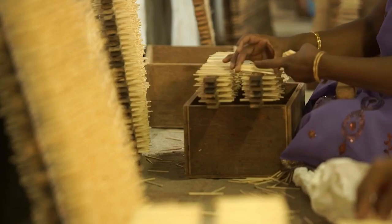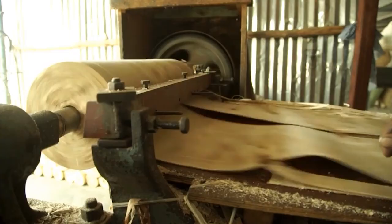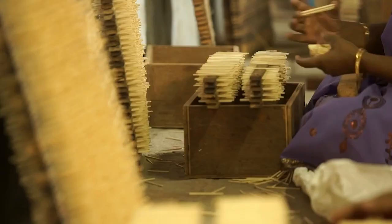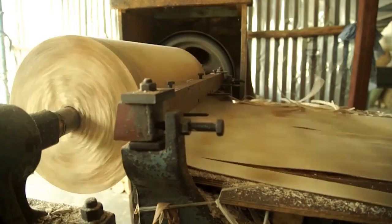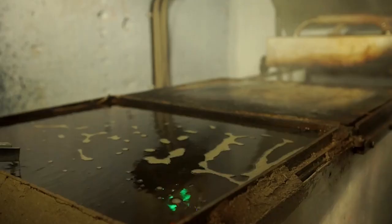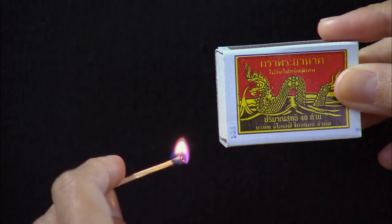Splints are made separately and are usually brought in from another factory, where they are made by cutting a few millimeter sheets of aspen wood called veneers into tiny little sticks. Aspen is chosen because of its cheap and light nature, as well as its low moisture content, which would interfere with burning. As an additional precaution, once the wood is brought into the matchstick factory, it is impregnated with chemicals like ammonium phosphate, which prevents afterglow, as well as some kinds of paraffin, which makes sure the stick burns evenly and slowly.